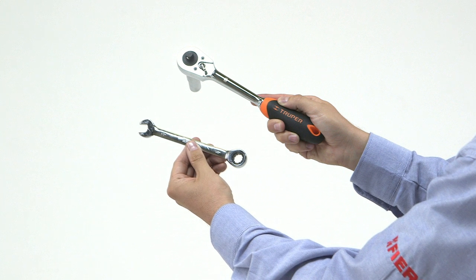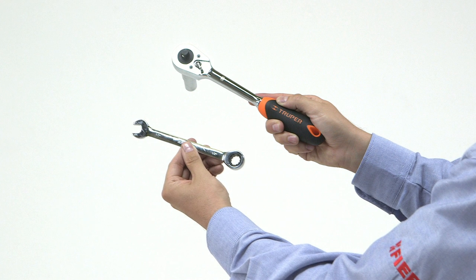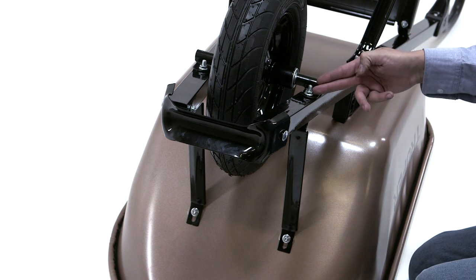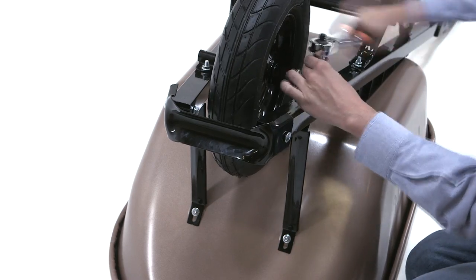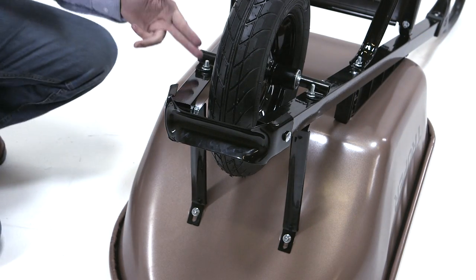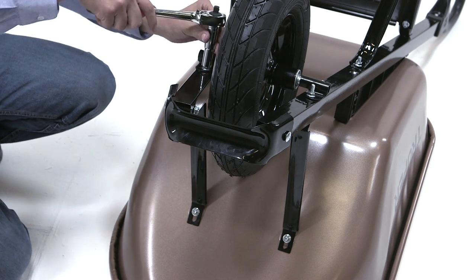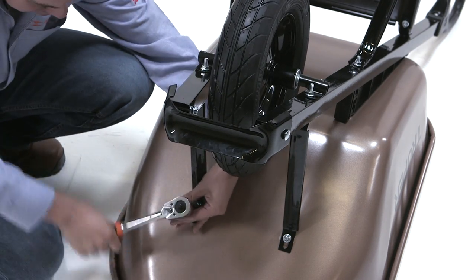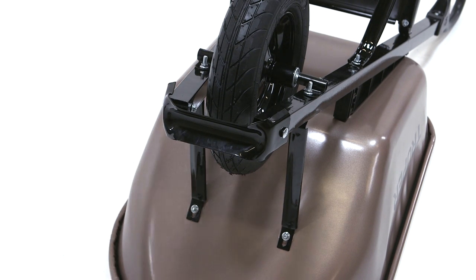Finally, once you completed the assemblage, firmly tighten all the nuts. Now it's turn for the 1/2 inch wrench or socket to work. Important: the tray braces are the first components to be tightened and have to be done evenly. To do so, go with the first nut and bring it to a soft grip. Same with the second one, and then go again with them, but a little tighter this time, without forcing the bolts.